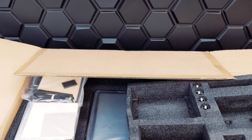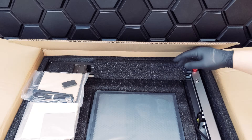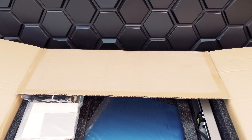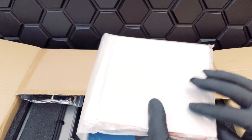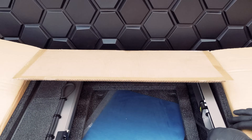The rotary roller is adjustable in width for various diameter ranges and keeps the object more steady. We won't be testing this today, but let us know if you're interested in another video to see this accessory in action. This is a honeycomb workbench for the laser engraver — it's 500 millimeters by 500 millimeters with an 8-millimeter large aperture. The honeycomb design contributes to faster heat dissipation and exhaustion of smoke. The honeycomb platform and aluminum plate are combined to protect the desktop from damage. The unit also comes with testing materials so you can find the optimal settings for your project. Remember, always test before you engrave.